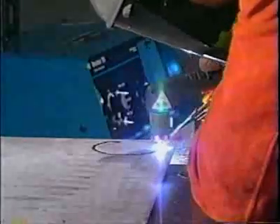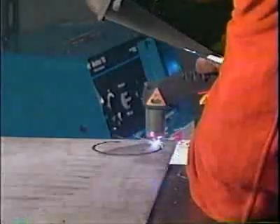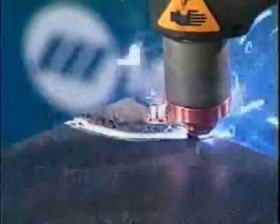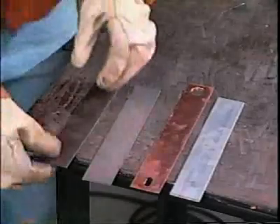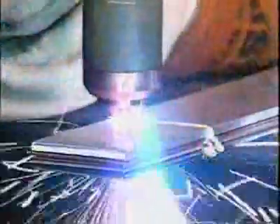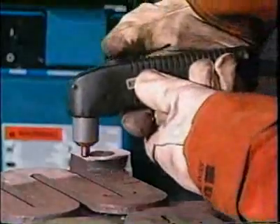Put simply, we'll be performing plasma arc cutting, and if we tilt the plasma arc torch we'll be performing plasma arc gouging. With a plasma cutting power source, a plasma torch, adequate compressed air, and electrical power, we can rapidly and precisely cut or pierce any electrically conductive material without preheating and with little or no heat affected zone. Aluminum, stainless steel, brass, copper, and even titanium are included — and as you can see, plasma cutting provides the solution to cutting stacked material.